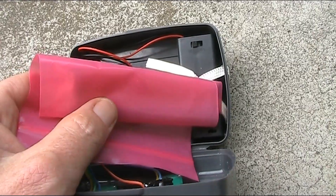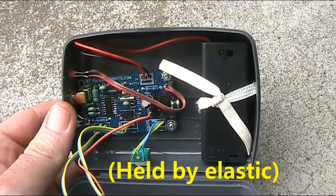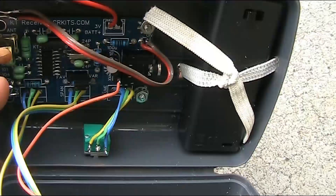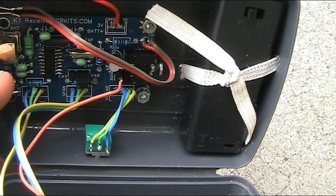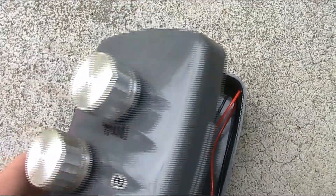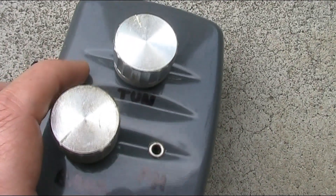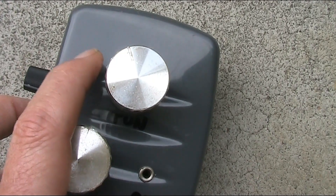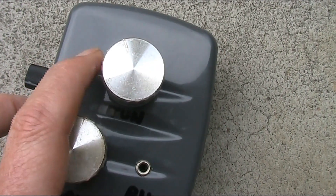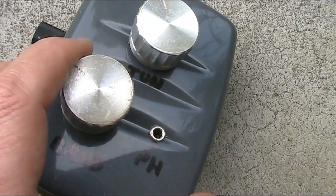In a bag for protection is the detachable antenna. On the bottom part is the main circuit board and the battery compartment. On the side, I've got the volume control, as that's the least critical. And on the front panel, I have the tuning control. You could have an even larger control on it — that would improve the tuning. You could even make a small dial. And here's the band selector potentiometer.